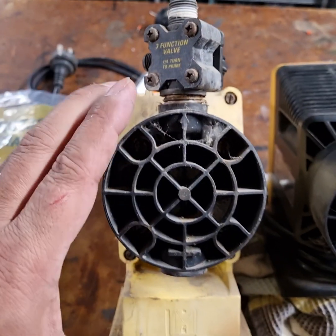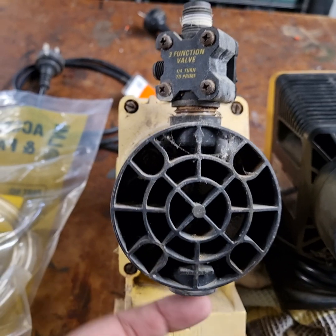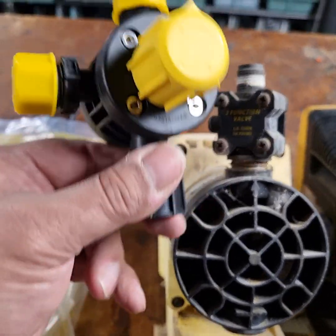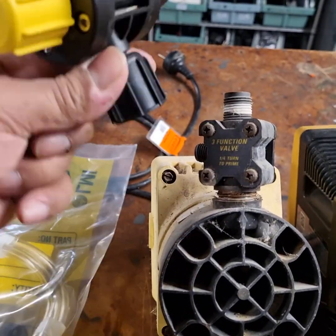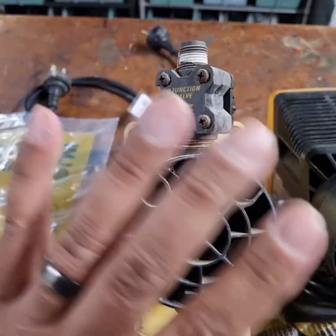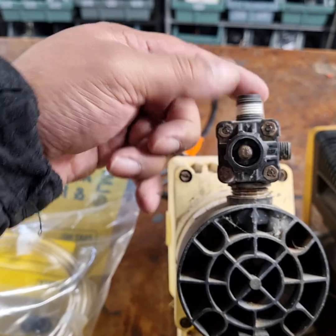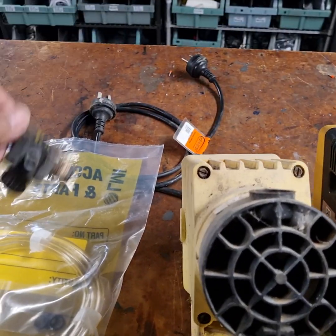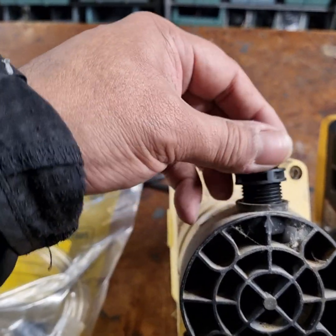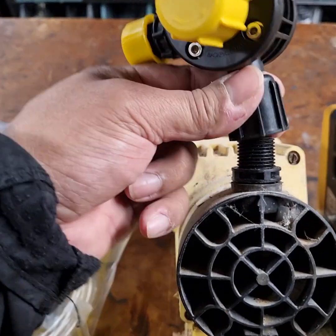This is a normal old LMI pump — they look old because they're just some of our used and abused models. What you've got here is a suction valve, a head block, and then a three-function valve. But as you can see, this new multifunction valve requires a valve connection. So if you've got an old pump and the old valve is faulty, you'd remove it and get what we call a valve housing — this little piece here — that goes on top, which allows the new multifunction valve to connect to it.